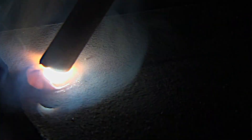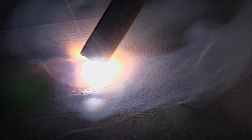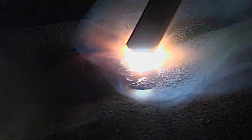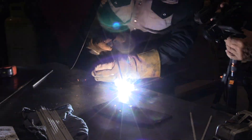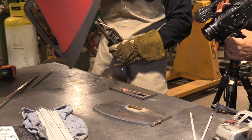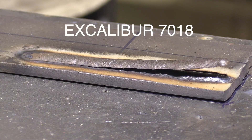We'll use the Lincoln Excalibur first at 125 amps. The recommended amperage range for these two rods is slightly different, and you could say that about most 7018s — they all need up five, down five, they're all a little bit different. But 125 amps is a really good starting point for a 7018 1/8-inch diameter. A good rule of thumb for 7018 is one amp per one thousandths of electrode diameter — that's the inner core, not the outside with all the flux.